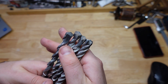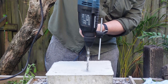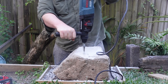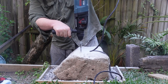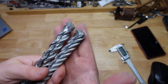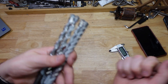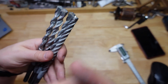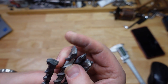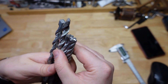To finish off, I also wanted to get an idea of lifetime. So I just kept on drilling — drilled up all that concrete, and when I ran out of concrete I went and got a bit of granite and went to town on that. About 15 holes in the granite as well with each one of these bits. Honestly, they still look like they're in pretty good nick. I was rougher than I would normally be — drilling downwards so the hole stayed full of dust, never cleaning them, never letting them cool. I tried my best to cook these bits and really wear them down, but it doesn't look like it really did all that much. They're a little bit duller, and the center plus has some of its little nubs worn down, but other than that they're all still in really good nick.